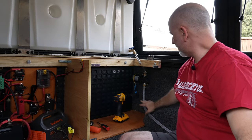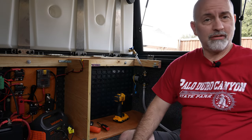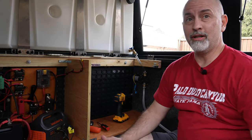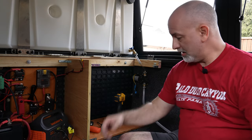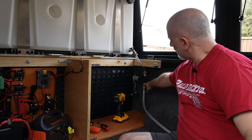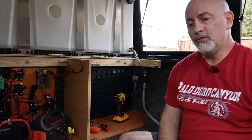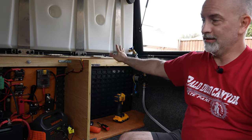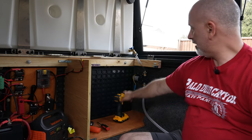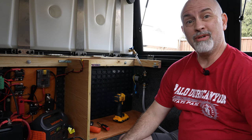We've got our hose hooked up from the water tank to the back of the cabin — just hanging out the door for now. I'm not connecting the faucet yet since it's still coming from Amazon. We've already pressure tested the connections and found them to be good. Now we're going to put water in the tank, verify no leaks one more time, and then pressure test the whole system using the Jackery battery and pump to make sure we won't spew water everywhere. Wish me luck.